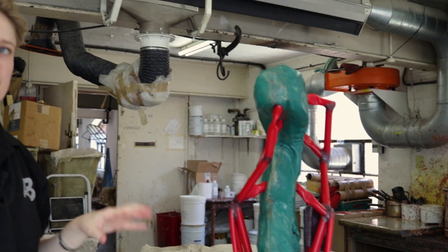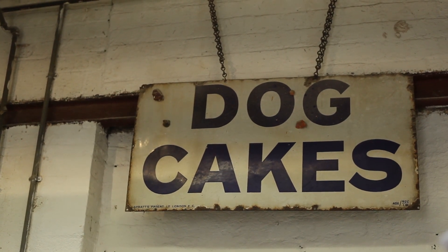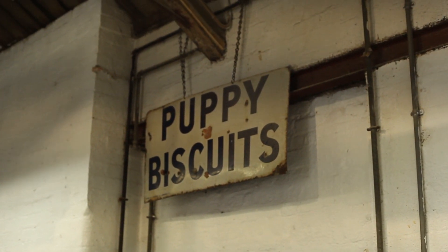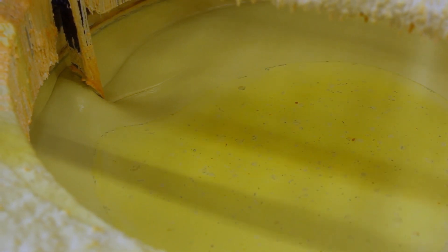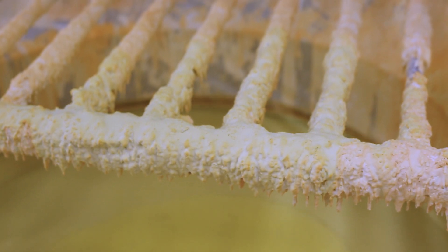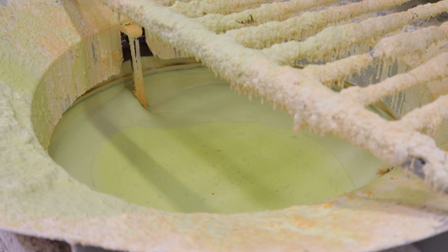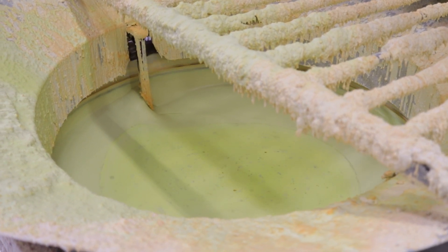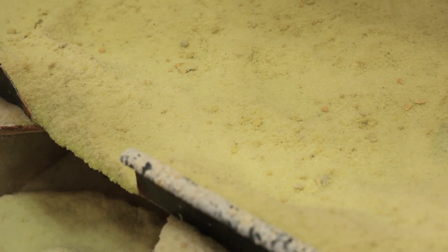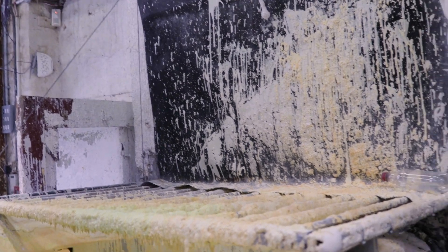So that's the main bit of planning that we have to do in this workshop. This is the next step of the process — every object comes down to this workshop called the shell shop. This tank is essentially a liquid ceramic; it's continuously turned because otherwise it solidifies. Every object that comes down has about 12 coats of this applied. The first couple of layers are really fine — we sieve out any bits that have already set.